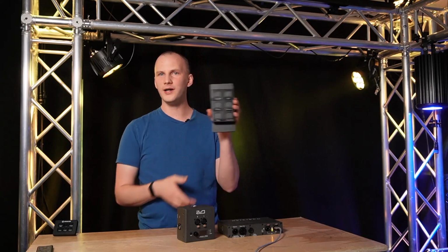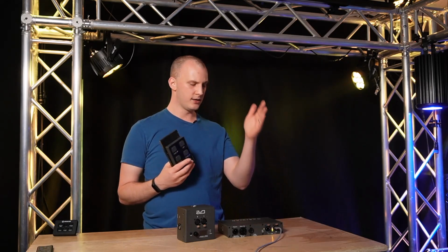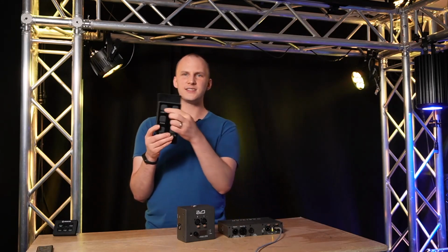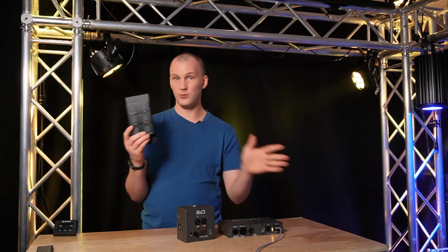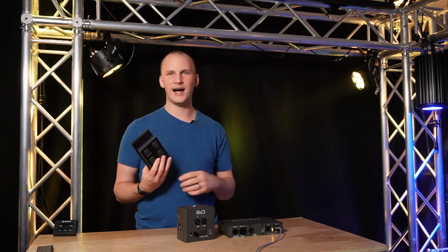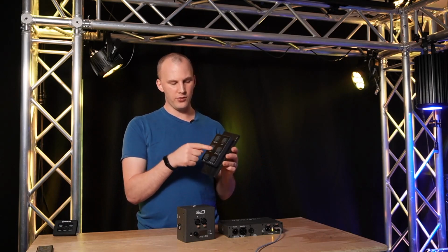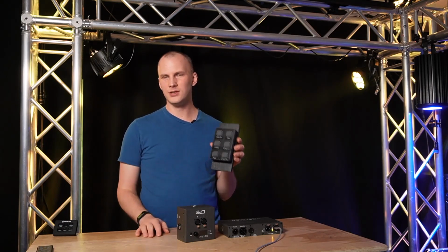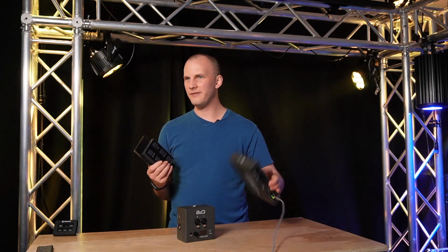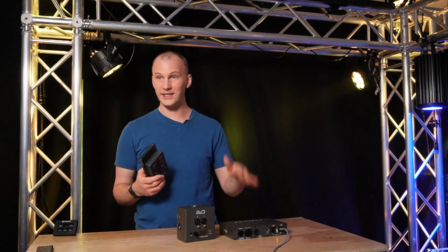You could put one of these in a venue with a Netron node. Again, anything that's like EN4, EP4, or above, okay? You could set these buttons, 1, 2, 3, 4, 5, 6, if you were just going simple, to send out on, say, universe, I just choose like a higher universe, honestly, universe 99, DMX channel 1 at full, 2 at full, 3 at full, 4 at full, 5 at full, 6 at full, okay? That could then fire 6 different cues that fire the 4 universes of data that you stored into this EN4.